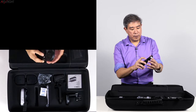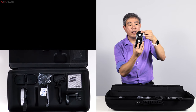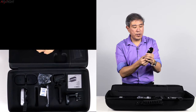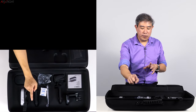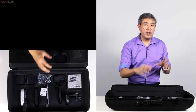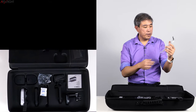There's the base. The nice thing about the spectrophotometer is that on the base itself there's always this ceramic tile — this is a custom white point that is custom programmed to every single color spectrophotometer device. Every time before you run a calibration, you're supposed to calibrate on this first to measure the white point, so you get the most accurate color possible.